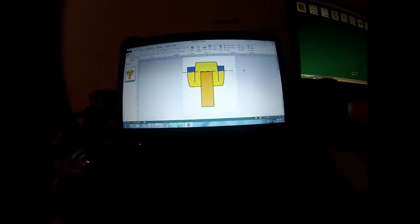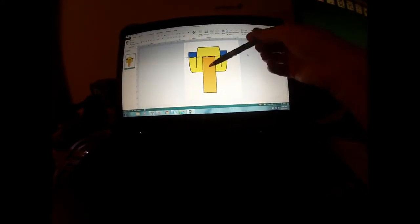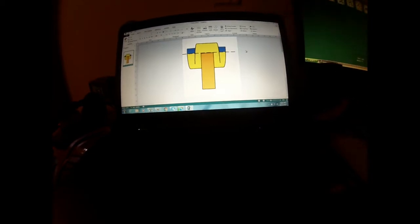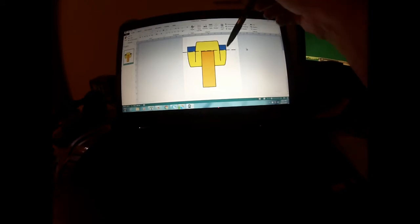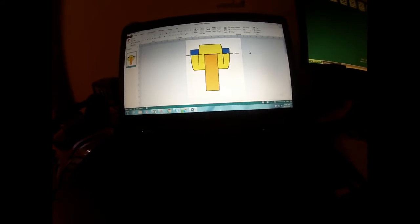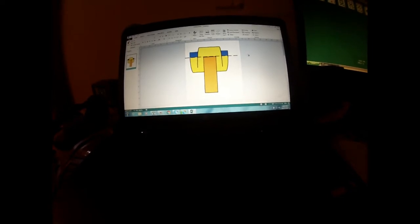How to make your own waterless urinal. Okay, so this is basically how a waterless urinal works. You have your drain tube. The drain tube comes up through the bottom of a catch basin. Within the catch basin, there is an inverted cup. Surrounding that inverted cup in the catch basin, you have some sort of light oil. A vegetable oil would work, olive oil. I don't think a volatile oil would be a good idea because it would evaporate off. But vegetable oil works really nice.